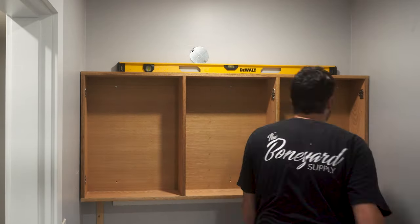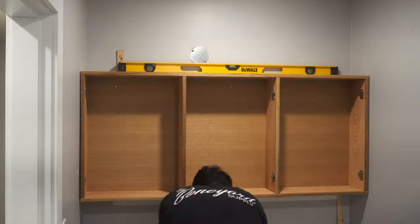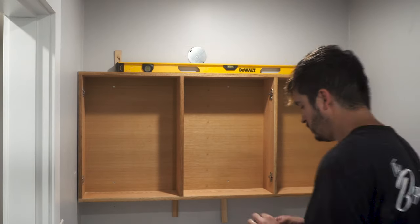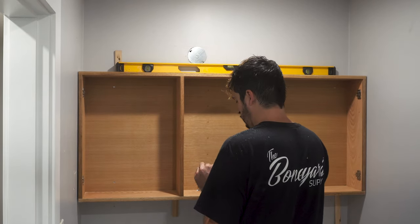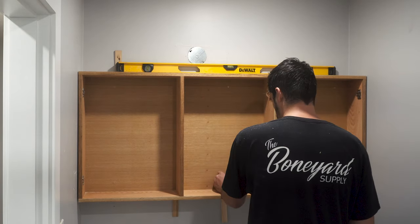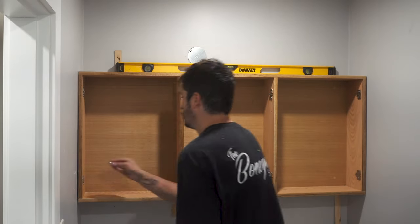I then fixed the cabinet to the studs using the holes that I pre-marked, and then covered any screw holes using oak fast caps. These are pretty handy and I'll link them in the description down below. They come in all different kinds of wood types and colors. And then I added all the shelf pins ready for the shelves.